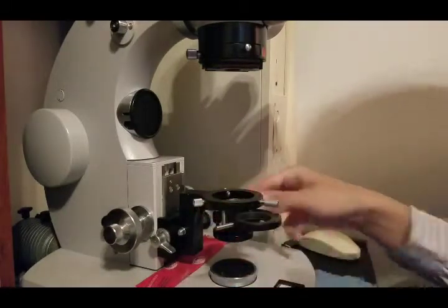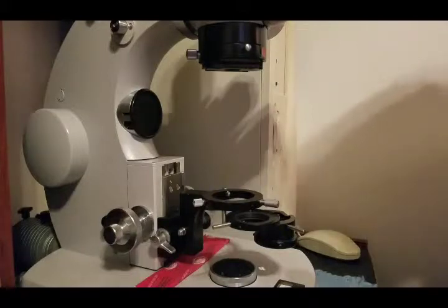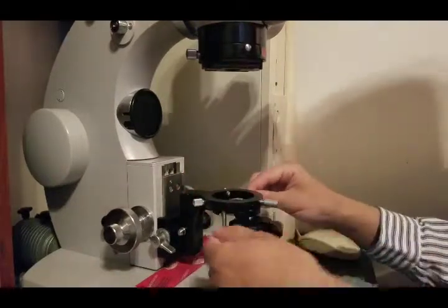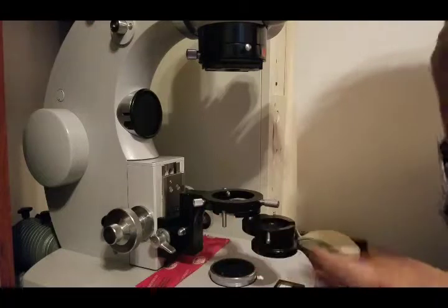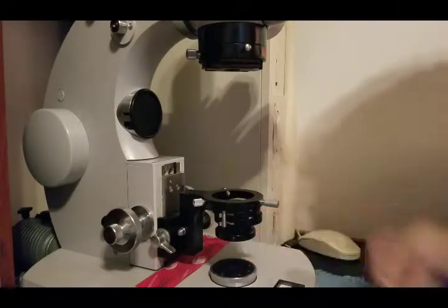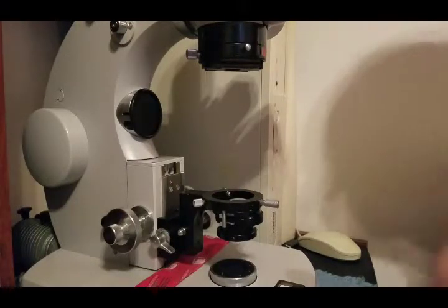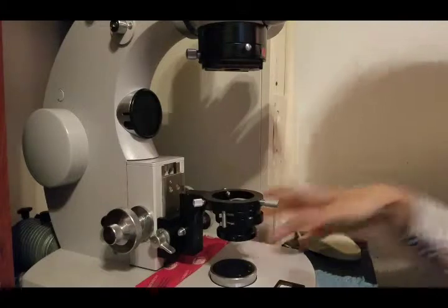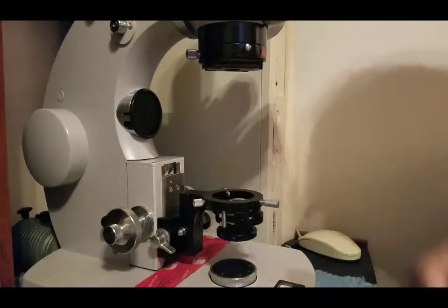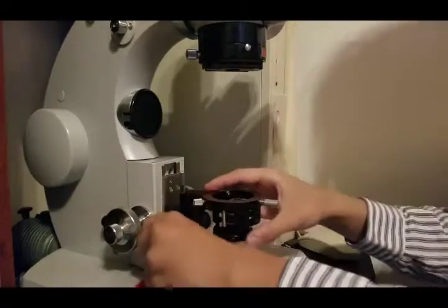Of course you have a place to put various different things - you could put polarized discs in here so that you can do polarized light. You have the normal condenser here which magnifies a tiny bit, and you can also add colored discs into both of these. Currently I have a blue one down below because the light I have is a halogen light and it produces a very yellow color scheme - sometimes you don't want that and you want white light. The best way to do that is to use a blue filter. This thing has two blue filters on it because somebody figured that was going to be a problem, and it is. So it's got two condensers here, and of course this comes off as well.